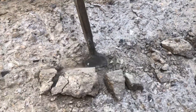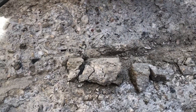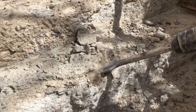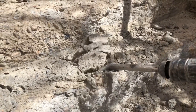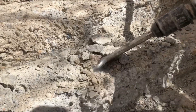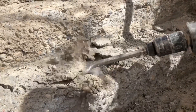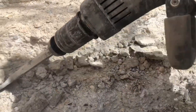You're going to see it all vibrating, so you know right away that whole piece is loose and ready to come off. If you're trying to grind or pressure wash over that, that piece is going to stay there, but in reality it's no longer bonded, it's no longer structurally intact, and it needs to be completely removed to ensure the success of your restoration. I mean, 90% or more of the success of your restoration projects are going to come down to how well you prep the surface.